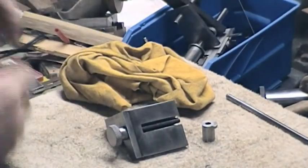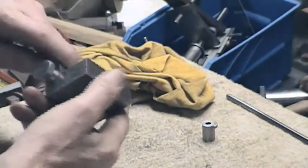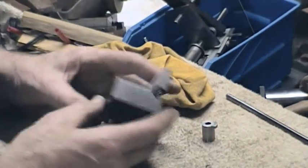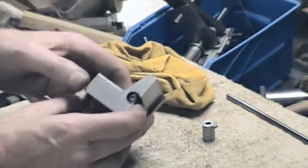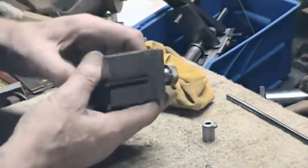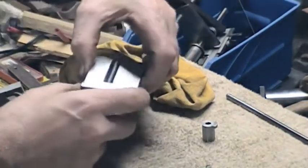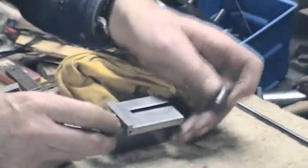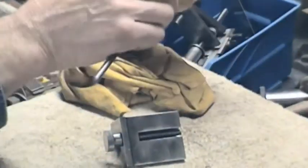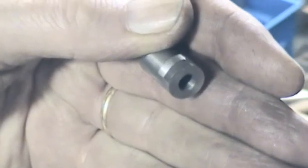Another early piece that was made — this goes back to about 1988, there's a date on it. This was a two-by-two lump of steel, basically mild steel, so we shaped that out. I think this was actually from a magazine — the basic idea — and it seemed worth trying. Once it's shaped it's been milled out on the back here and polished up. All we've got then is a thread and a knob, and this little piece — you see it's out of a piece of round that's turned down, and we've kept a little lug with a thread down the middle.